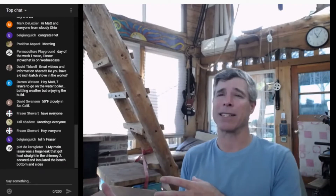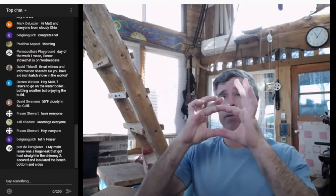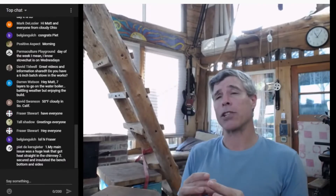So if you have a six-inch round chimney, that's going to be roughly — and I'm just approximating — but roughly three inches square for each of those openings. In my tests, secondary air is actually ever so slightly smaller; I want to say it's 9.82% or something like that. Belgian Gulch might know those numbers offhand. But it's roughly 10% for each opening — 10% for the primary and 10% for the secondary. It works out to about three inches square of cross-sectional area.